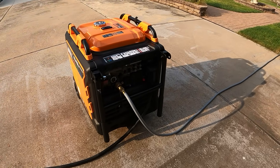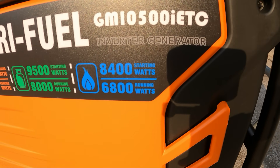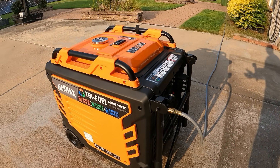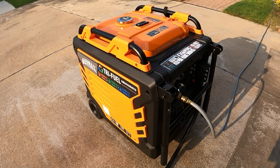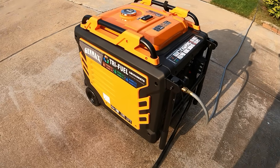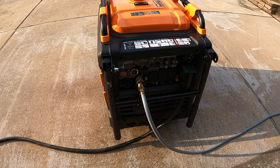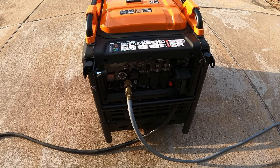On the 10-5, running on natural gas gives you this rating right here: 8,400 starting / 6,800 running. On propane: 9,500 starting / 8,000 running. On gasoline: 10,500 starting / 8,500 running. Because it's tri-fuel, you can run it on just gas, just propane, or just natural gas — whatever your preference. If you want 10,500 watts at your disposal, you can get it. For those who ordered from my website, gavinsgarage.com, it's on sale there. We'll be running the AC, refrigerator, and some ceiling fans — we only have around 6,800 watts to play with on natural gas, so we have to be mindful.